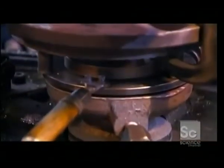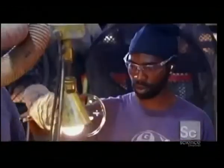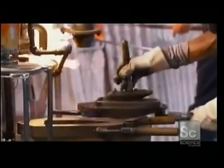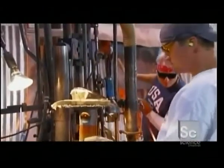This circular mold makes theatrical and landscape lighting. Again, a gob of molten glass is dropped in the mold, and the plunger is depressed, forming the lens. Heat-resistant tongs enable workers to handle the hot lenses. Red and yellow lenses need a high-temperature anneal for the color to appear. This is called striking.